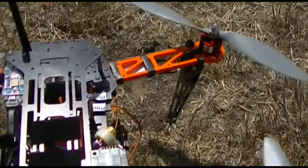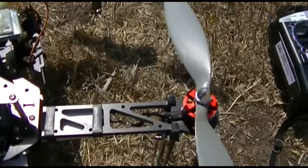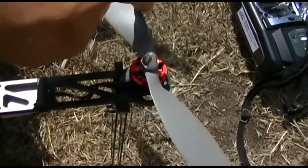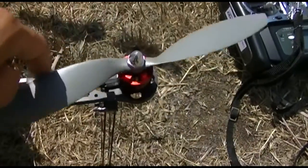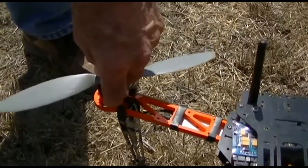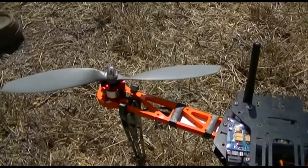With the camera sampling at 30 frames per second you can see them changing speed to hold position. The magnets are pretty strong and it's quite a routine in balancing. I figured out a way to balance the motors — you can see I've got some adhesive-backed aluminum foil stuck on there. I balance the propellers first, then balance the motors, and now I'm going to go back and balance them as a unit.